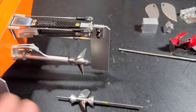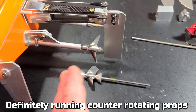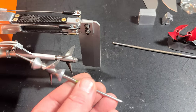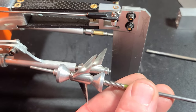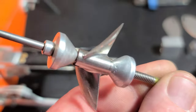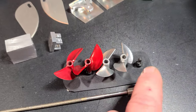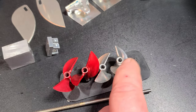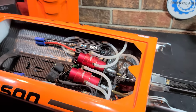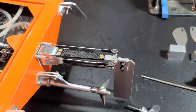For the first run, we're actually going to run left-hand lay same-direction propellers on both sides until I get my 4mm cable in. I'm balancing and thinning one prop to match the other. Once the cable is in, we have a 42x14, a 38x14, and a 42 high-rake prop to run on the boat.